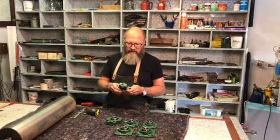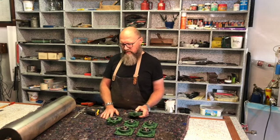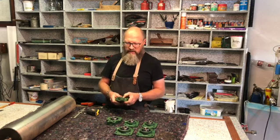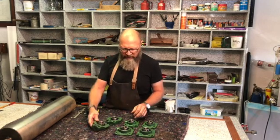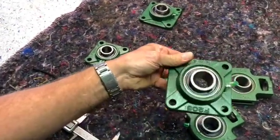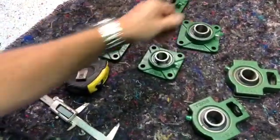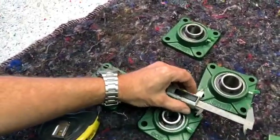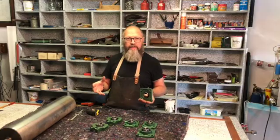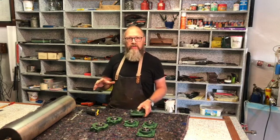I'm just going to take it step by step. The first step is to get your materials, start sourcing them, and see what's available. I also had to get other bearings for the fixed roller — also 30 millimeters — but with four holes. Those holes needed to be measured and drawn up in a CAD program so I could produce laser cut files for the parts.